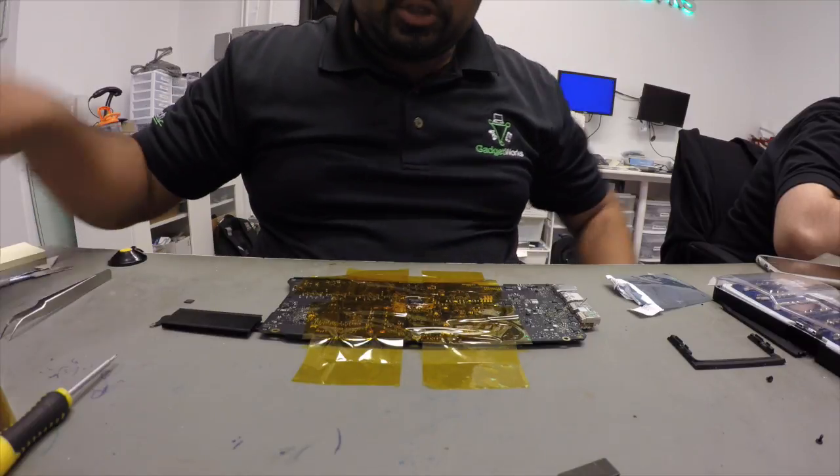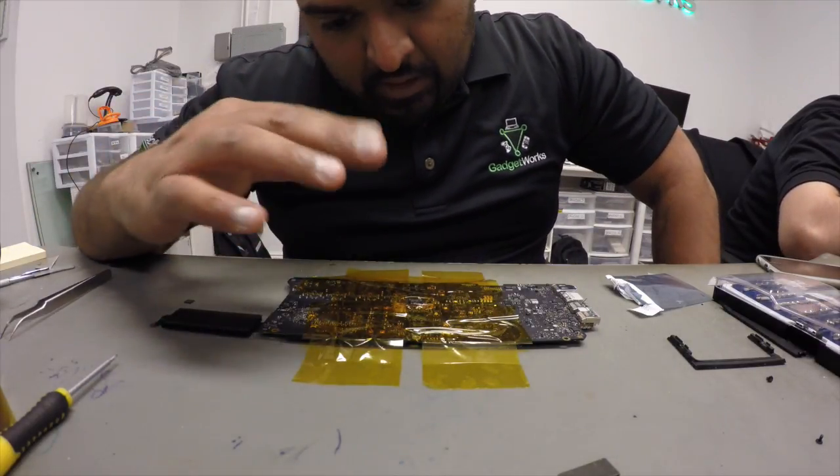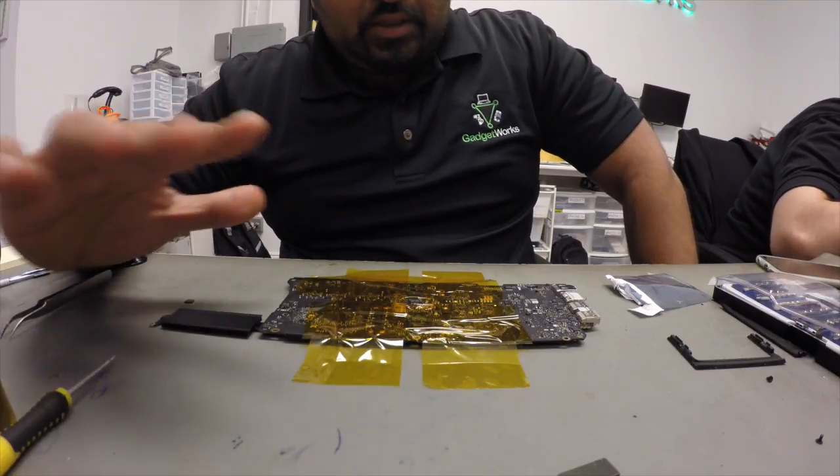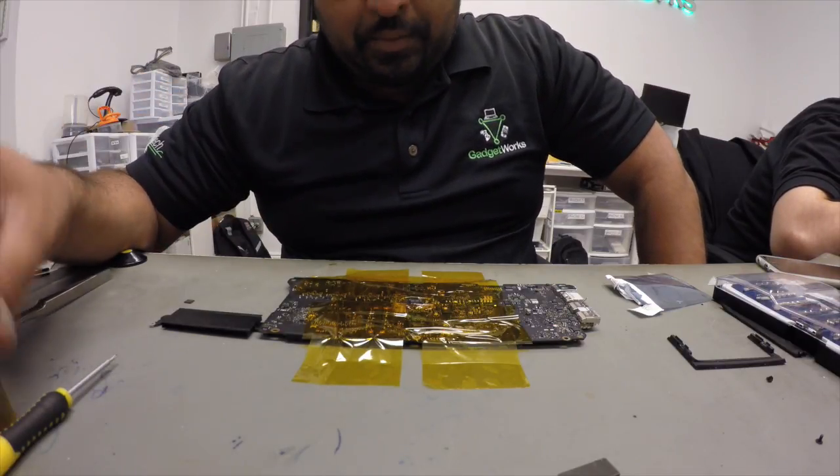The reason I was bumping the chip is that usually when you hit it just a little bit it will not get into the right position on its own. But when you have the flux underneath the chip, your chip will automatically just spring into the right position.